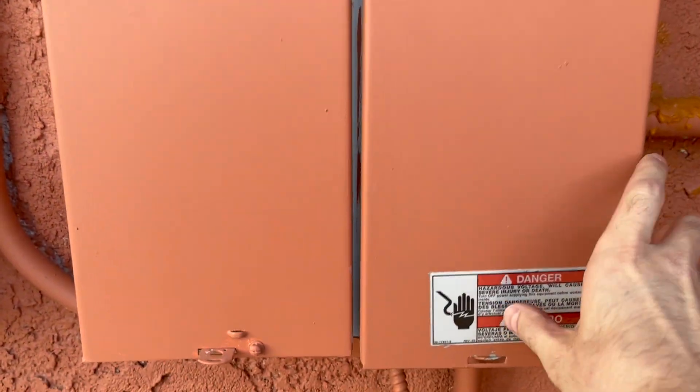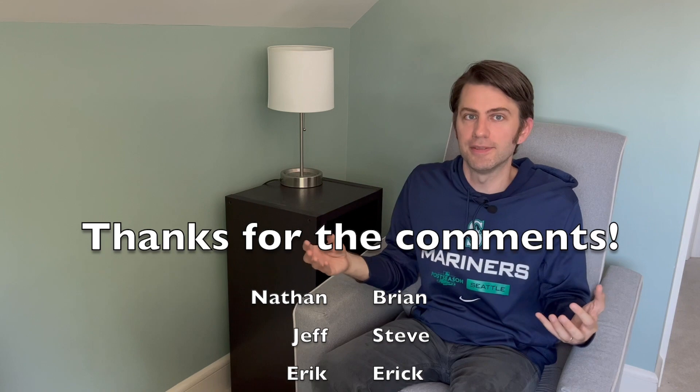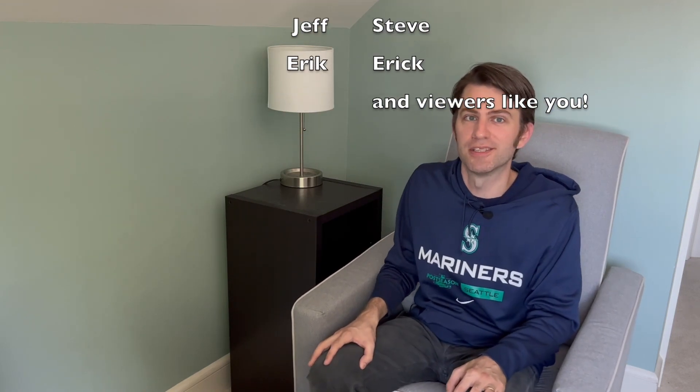So that's how I installed flush valves on this water heater. Some important lessons learned: first, avoid complicating the plumbing — the less connections you have, the less plumber's tape, the less opportunity for leaks. I hope you got something from this, but let me know if you noticed something I could have done differently, and keep coming with those ideas for future videos. On the next video, I'll show how I used the flush valve to set the right flow rate and avoid the need for the flow restrictor. I might even publish a video showing different flow rates of different fixtures in the house to give you an idea how large of a water heater you might need. Make sure you subscribe so you can catch the next ones. Goodbye!